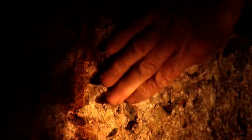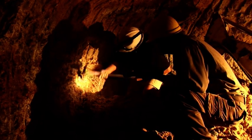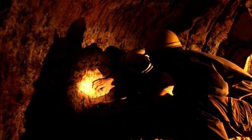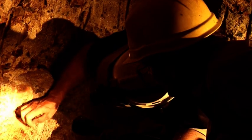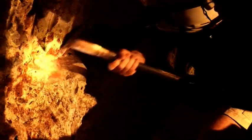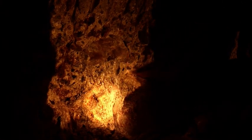So you think there's ironstone in there, but you can get identical stuff, you know, the wash looks the same in a different place and it'll pay really well in some places, just in the right place. And then it won't pay that well in other places. Get you all excited because you identify the same stuff, and there's little tiny bits of concentrate there, and lots of ironstone. You see it all in here, bits of yellow, isn't it? Just underneath the drop. Not a lot of definition between the wash and the floor. Yes, that's the floor, that's decomposed granite.